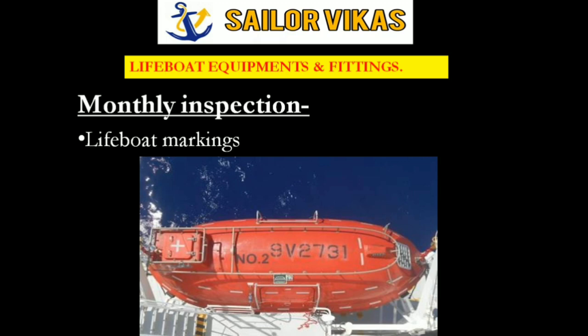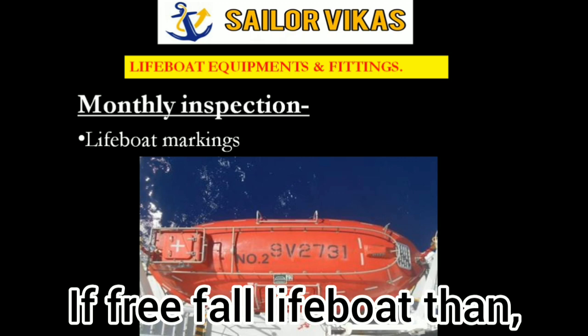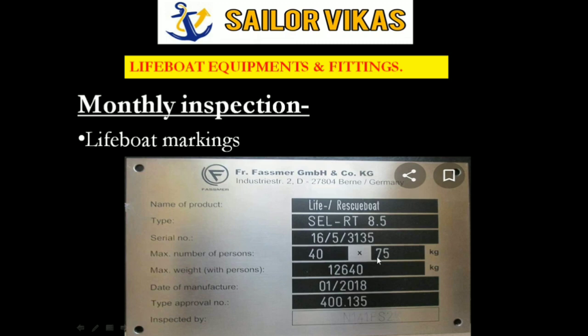The second thing which we will see is the markings on the lifeboat hull. First we saw the certificate of approval. Now if it is a free fall lifeboat, then in the certificate of approval there should also be the free fall certification height mentioned, and the required launching ramp length should also be mentioned in the certificate of approval plate. But since this was a side lifeboat, it is not mentioned here.